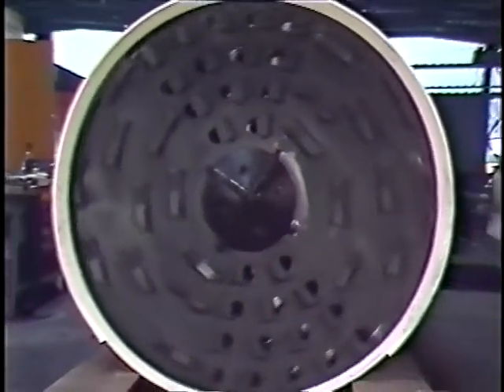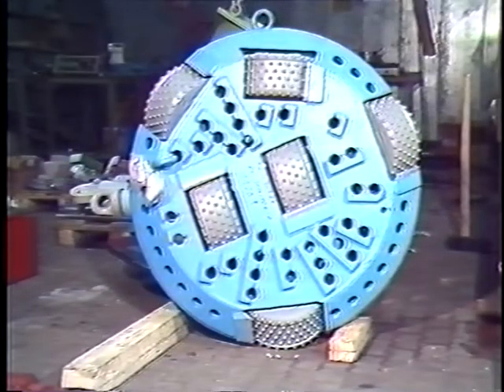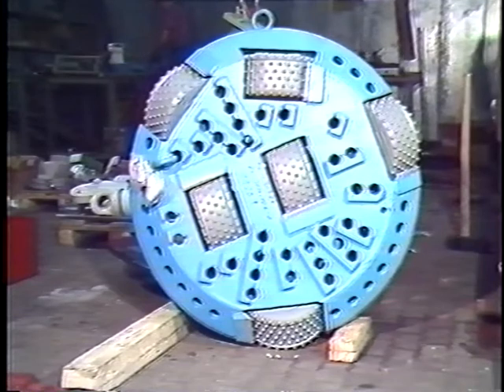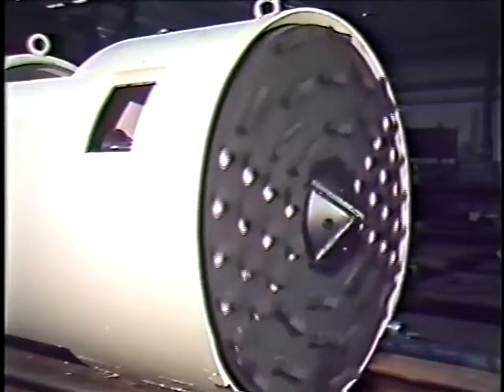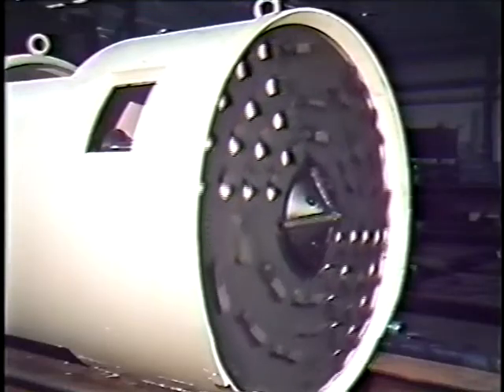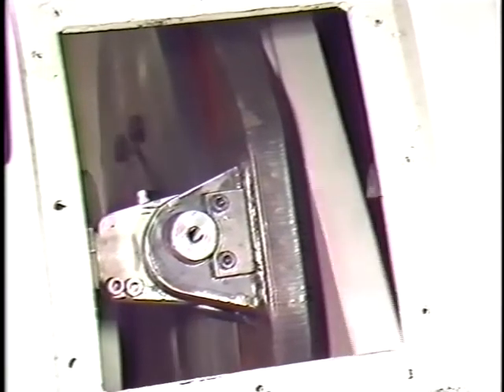The decisive advantages of the MGF system are, firstly, a full-face machine for loose earthwork can be converted into a solid rock cutting machine just by changing the boring head and making minor modifications. Second, the boring head, which can travel axially, is supported on a pressurised oil cushion. If obstructions along the drilling route raise the compressing pressure above the permissible level, then the boring head reverses for a short distance and the main compressing station cuts out to prevent damage to the machine.